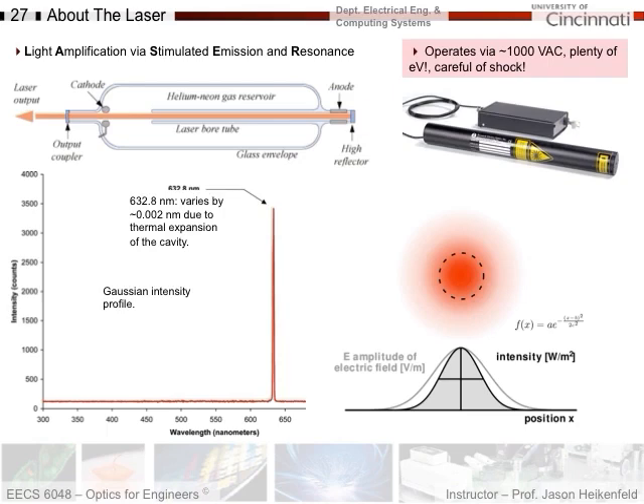To create this high voltage, there's a high voltage source, and when you disconnect the laser there can still be a very high voltage across the electrodes — the cathode and the anode. So be very careful: if you disconnect the laser there'll be two metal leads — do not touch them to your skin. It won't kill you, but I've done it myself two or three times and it gives you a nasty shock. So shut the laser down, leave it attached, don't just pull the cords out.